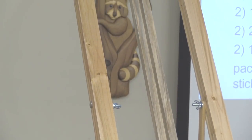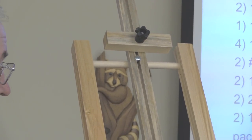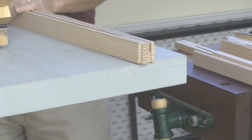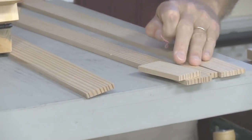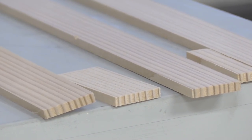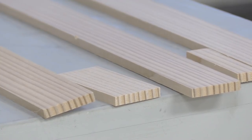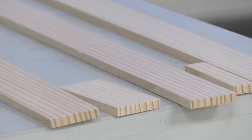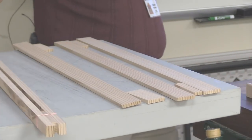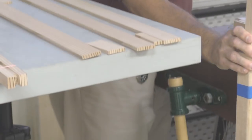So literally, the other part of that, instead of using a shaper or a router table, is I just cut quarter-inch slots or quarter-inch pieces of wood to glue up the legs. Which also uses less wood than using a 1.5 by 1.5 piece and cutting slots. I need to wax it a little bit more, so I don't use it that much. But basically, a table saw and a sander. Drill press helps a little bit, but it's fairly straightforward. There you go. There's your 2x4 chopped up into usable pieces.